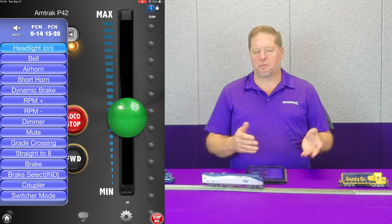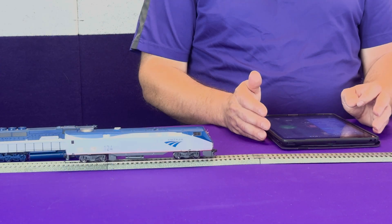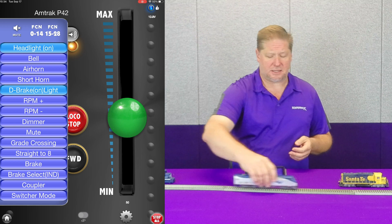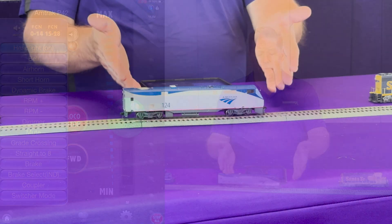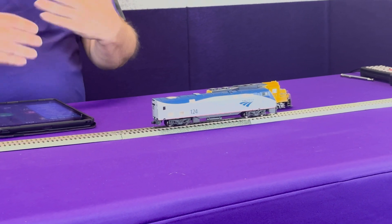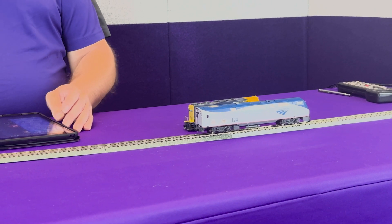Now I'm going to get my locomotive moving a little faster. When I apply the dynamic brakes — starting right here — you can hear that dynamic brake fan kick on, but the locomotive maintains its given speed. This is just the base application of the dynamic brakes. But now when we press the second application, you can hear those fans kick up and get louder, and now you notice the locomotive is actually slowing. Once it gets down to about seven to ten miles an hour, it's maintaining its speed. The dynamic brake fans go down and now we have our monitoring speed maintained. When I release the dynamic brakes, the dynamic brake fan kicks off and the locomotive starts accelerating again.